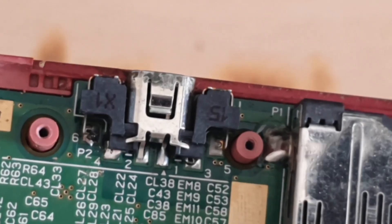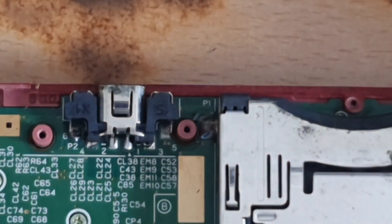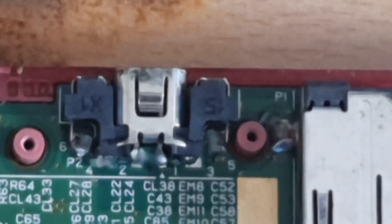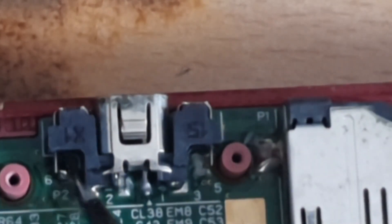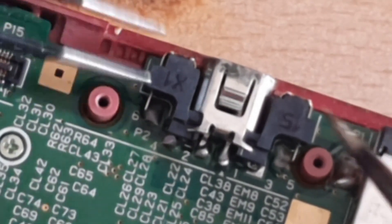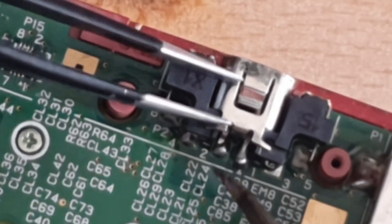Now we're ready to install — we've desoldered at that point. Just check if it's the right size and fit; it should be. Set your iron to the correct temperature. I don't know what iron you're using, but anything above 300°C should be good enough. I've fluxed all of the points, and I've used leaded solder as well to lower the melting point of the already existing solder. Keep your iron on the point for a couple of seconds depending on the temperature and the characteristics of your solder type.